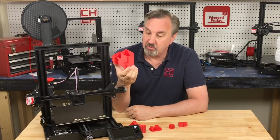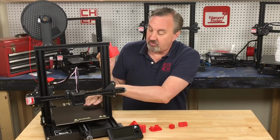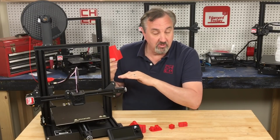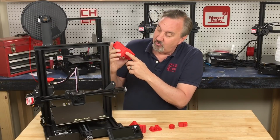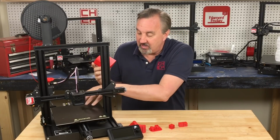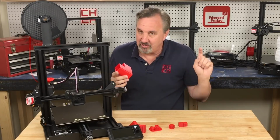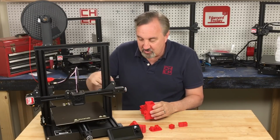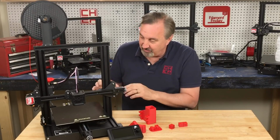But it's actually a nice print to test. The walls are nice and straight and smooth. It's a pretty good print. But I also found out that the bed, even though I had it really leveled very nicely using my manual bed level, lifted, it warped in one spot. So this clearly, and I found that with other prints, does not grip as well as the V2 glass bed. This one, I think I'd have actually put a little glue on it. So that's a little different.